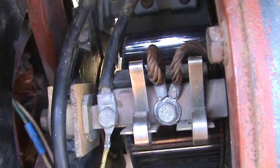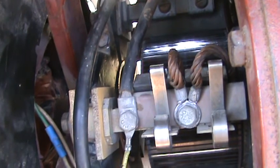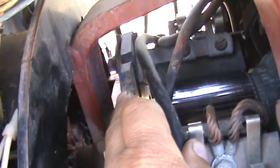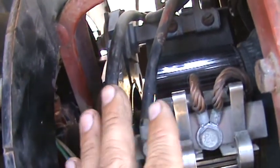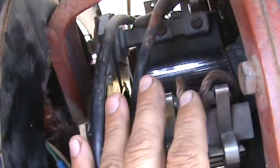If you buy a machine and it's all screwed up, more likely somebody's been trying to roll the rack on the commutator. You loosen this bolt right here — if you twist this rack up towards the direction of my hand, you're getting hotter, and if you pull it down, you're getting colder.